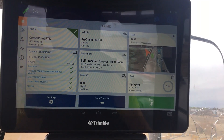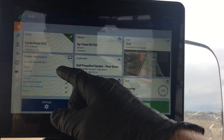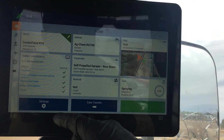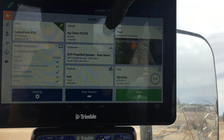These are the different blocks. You just make sure that you're set on the right one. Your satellite should stay the same, whatever it was before. In this case, we're doing RTK on a radio. These are check marks. You'll also see that there's one more down there that's internet — that'll go away when the internet's not connected. You can connect to a hotspot in order to do a remote session if you need help.